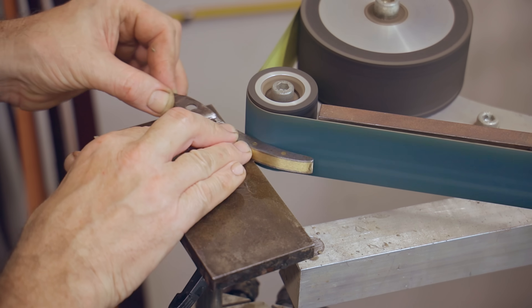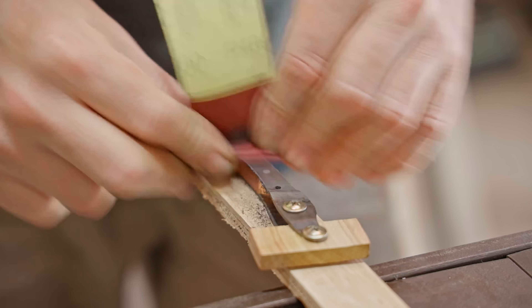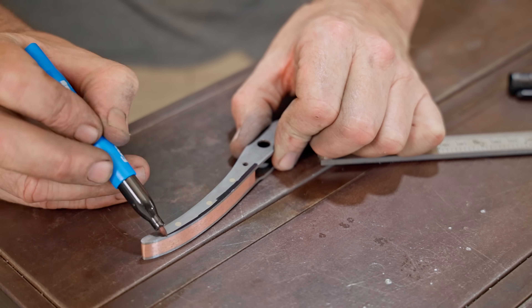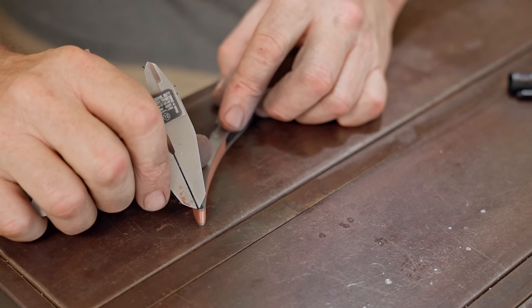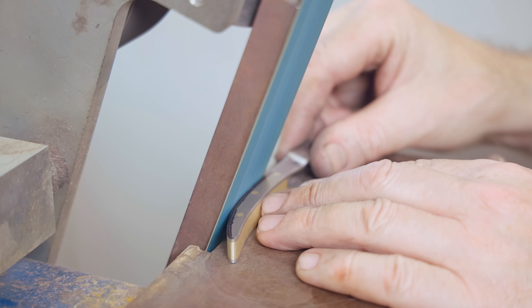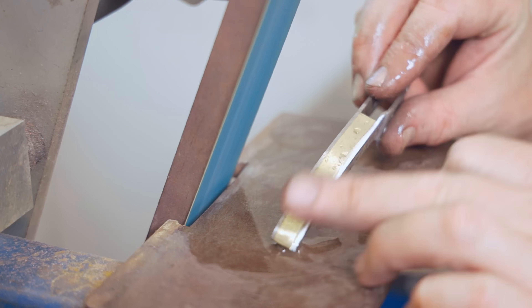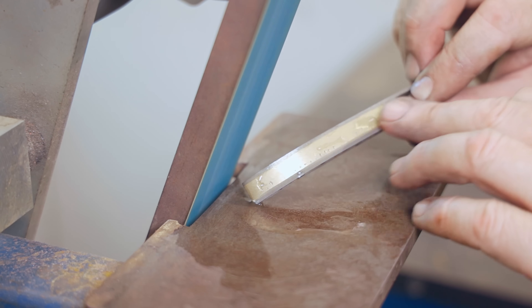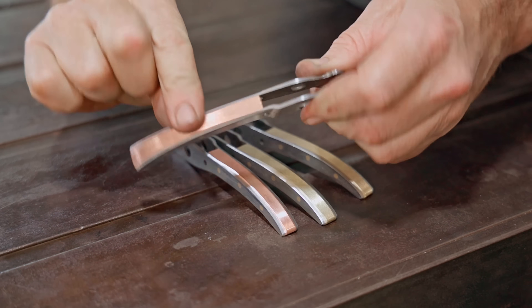I finished it off with a finer belt and then did some hand sanding, mainly on the face of the bridge as that was more difficult to do with the belt. They're starting to look good but they do need the outside edge rounding over to make them more comfortable to hold. I'll do that by grinding a bevel and then blending those in afterwards. That already feels much better, but next I'll sand and round over the bevels.